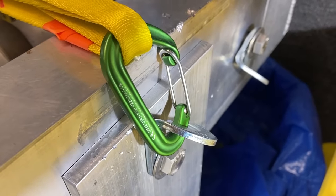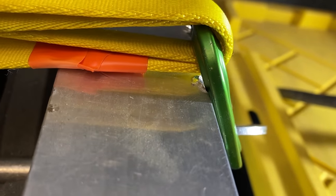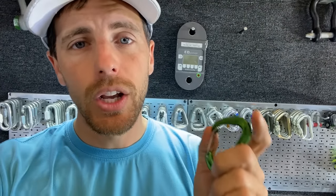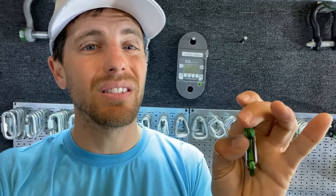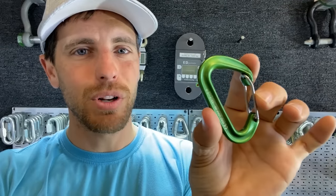I'm wondering if size matters — of course it does — but also how much it's levered matters. If I put this on there it's only going to be barely sticking up over the top, but it's a smaller carabiner. This could happen if somebody doesn't place a bolt well and it's going over an edge, or if you put in a cam deep-ish but not deep enough so the carabiner is being loaded over an edge. I've placed cams to rig highlines and sometimes the carabiner wants to lever against the edge — this is pretty sketchy. Put in the comments below if you've ever seen it or done it. Don't do it.